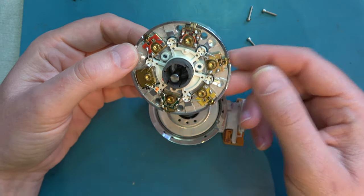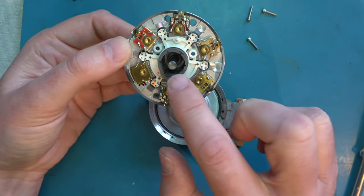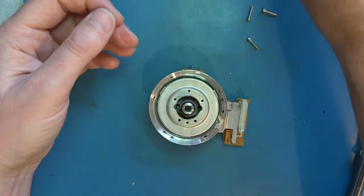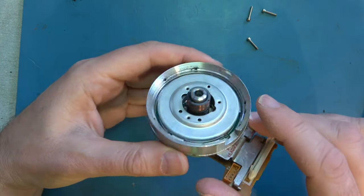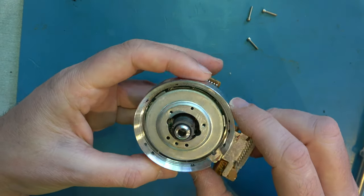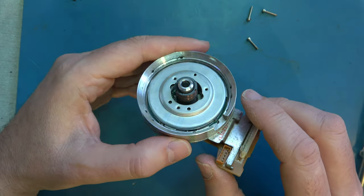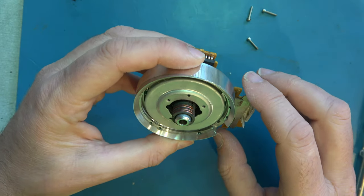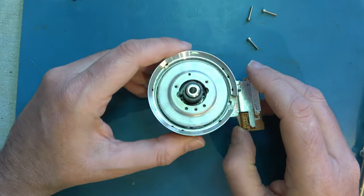So, there are a number of windings in the inside of this rotary transformer here. And they correspond to windings on the lower drum. As we can see here. How many of those are there? I can't see all the way down to the bottom. It looks like about 6 or 7. Looks about right. And one of those, somewhere along the line, is going open circuit when the drum has been running for a few moments.